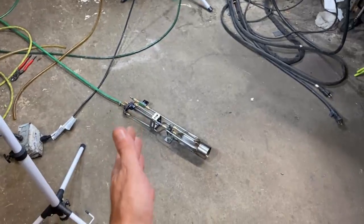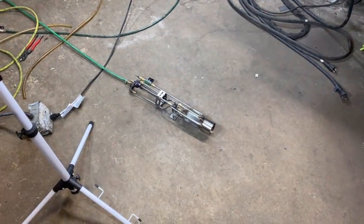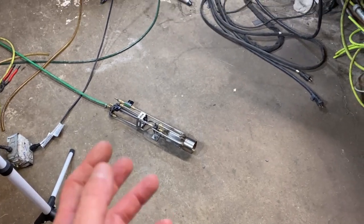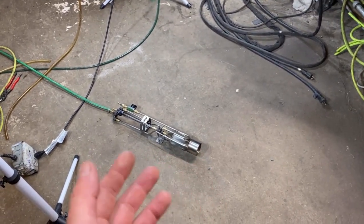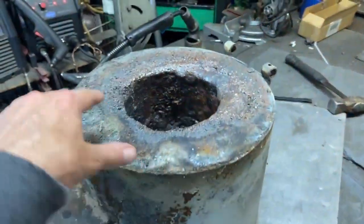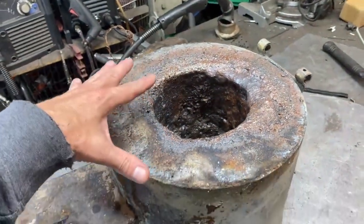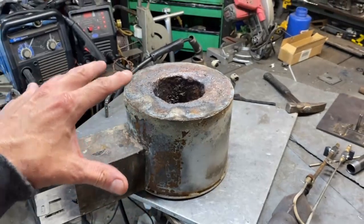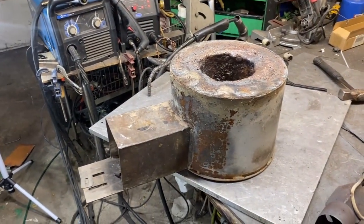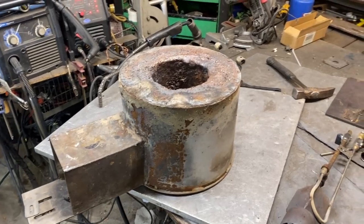Here's what we're going to do: we're going to run the burner on just diesel and compressed air to get us up to 2,600 degrees, then after about 15 to 20 minutes — to be sure that we're fully at temp, it can take up to a half hour to get one of these things up to maximum temperature — and I know that based on my anode sludge melting research.